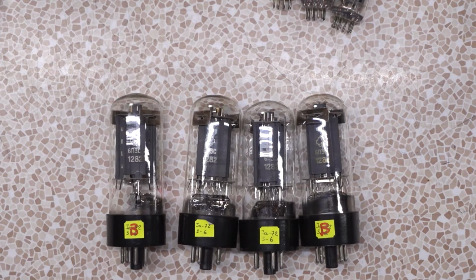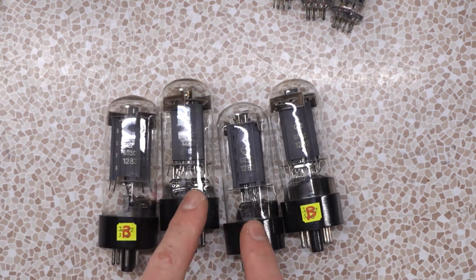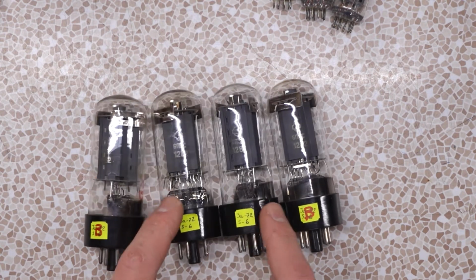It's almost like you'd need 4 tubes in a 2-tube amp to make them really... But hey, I do most of my playing at low volumes because I'm just noodling around in my room, so a 40-watt amp is more than enough. Just, you have to bias them cold. It's tricky. And they're NOS, and this particular seller matches them. So this is a match set. And indeed, like this pair here, they're within like 1 or 2 milliamps of each other. They're really close. So, enter the more interesting, debatably the feature presentation of this video.